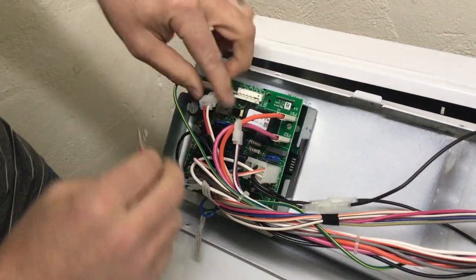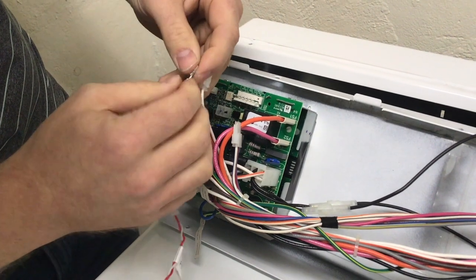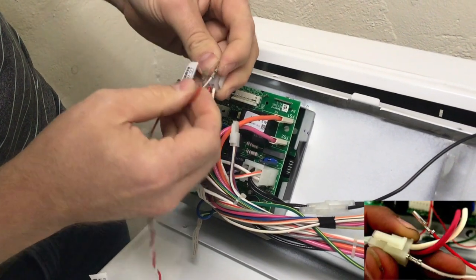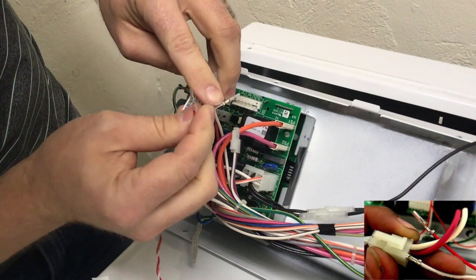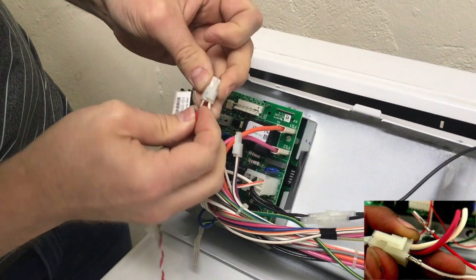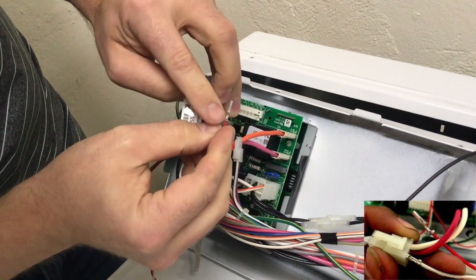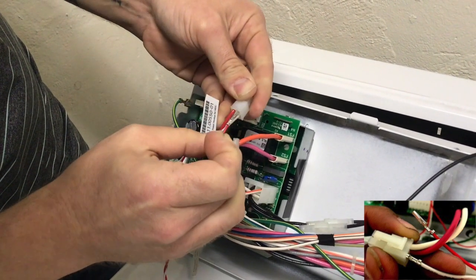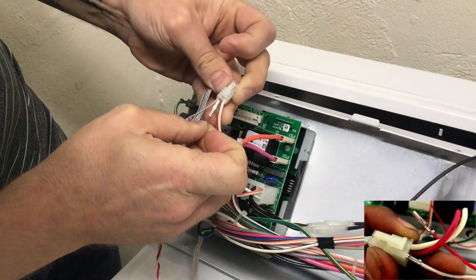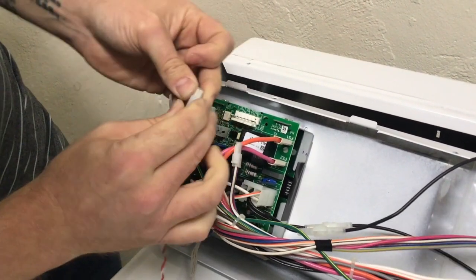From the pay range harness, insert the P1 pins into the two open slots in the H1 connector. The crimped edge of the pins must face towards the clip of the H1 connector. Inserting the pins in any other orientation will result in the pin getting disconnected. Please note this is AC voltage so polarity does not matter.